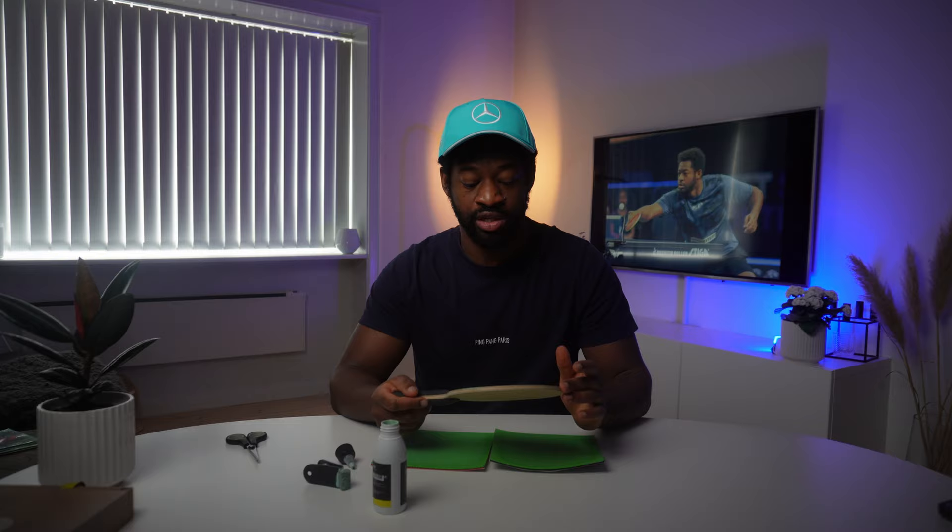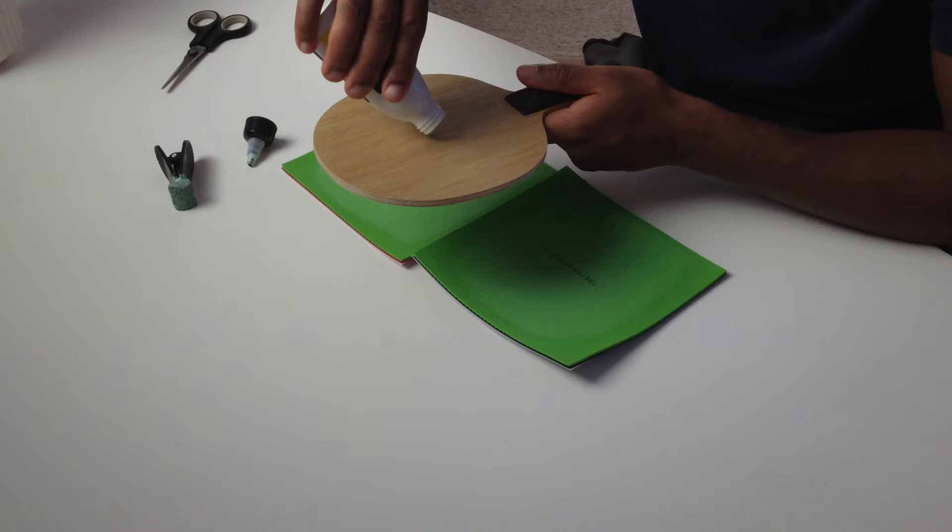Last time I had a lot of comments about why I'm putting glue on both sides of the blade directly, because when you try to glue it, it will ruin the glue. What you have to know is that this is contact glue and it's only meant to bond to the other surface that also has glue on it. So don't be afraid of putting glue on both sides directly to save time — it will not ruin your gluing, as long as there is no glue on the table.